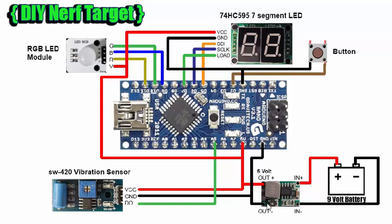Last but not least, I use a buck converter to drop the voltage from my 9V battery down to 5V. You can use this to adjust the output, but you will need a multimeter to track the output. And then there's just a normal button that you can find.